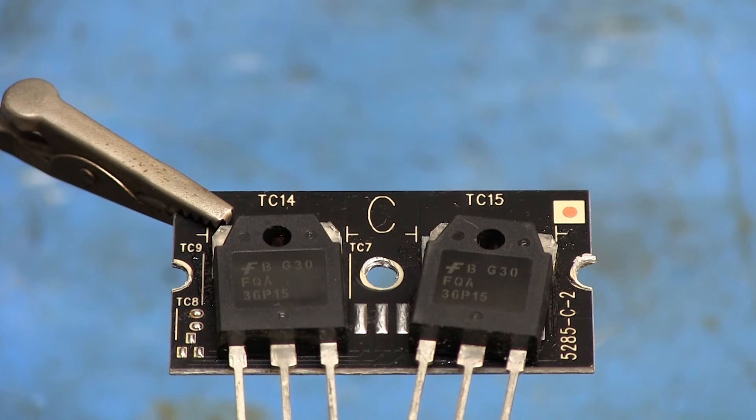The new parts are on, and as you'll notice I haven't placed them completely aligned on the pad — and we'll see why. Once the solder melts it'll just pull the part into place, which makes it a lot easier because you don't have to worry about trying to sit there and align it manually. We're going to begin by gently heating it on both sides with the heat gun. You want to be a lot more careful when installing than when removing because you don't want to damage the new parts. I'll gradually raise both temperatures and then towards the end blast the bottom until the solder melts enough for the MOSFETs to fall into place.